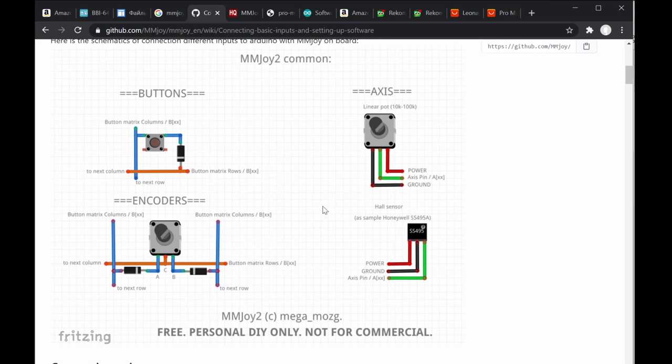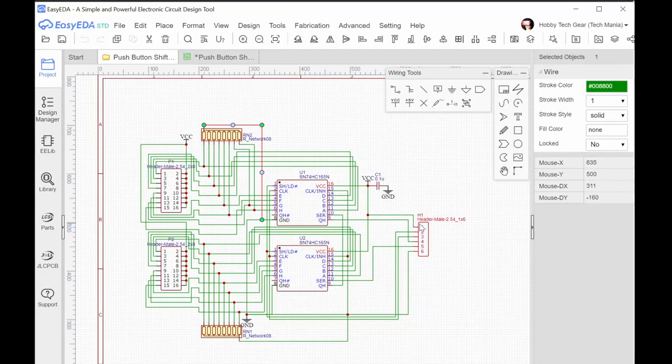This is how you connect the hardware — one of the most important steps before programming MMJoy. You need to decide which pins will be analog and which will be digital. The shift register board connects with plus 5V, ground, MOSI, serial clock, MISO, and chip select. MOSI carries data from one board to the next in a daisy-chain configuration.